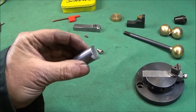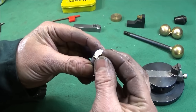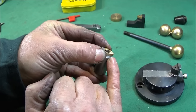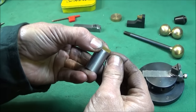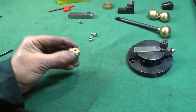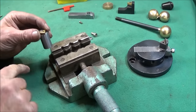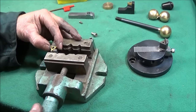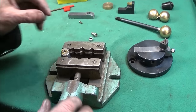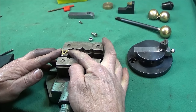So to cut a long story short, I've done the milling on that one and deburred it, and you can see the insert goes on there nice with a very slight overhang over the front there, probably about 20-30 thou overhang. And then all that I do is I get a nice vise like that, put it on a flat surface, put that part in that vise, tighten it up, and then I carefully check that the insert is dead equal on there and in the center,